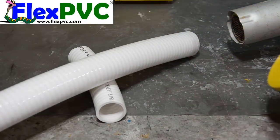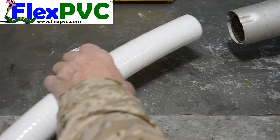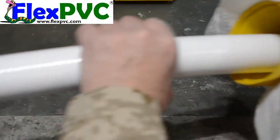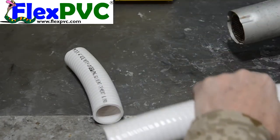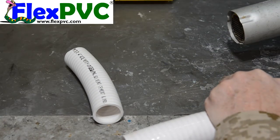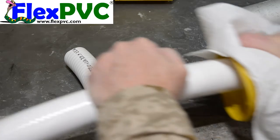You're going to need a product — a funnel. Everybody's got funnels. Plastic funnels work better than metal funnels. Just use a plastic funnel: take the hot end of the pipe and shove it into the funnel. Or if it's already attached to your spa or something, just shove your funnel over top of it and hold it. Let the pipe cool while it's touching the funnel, and that's going to take the end back down to a taper.